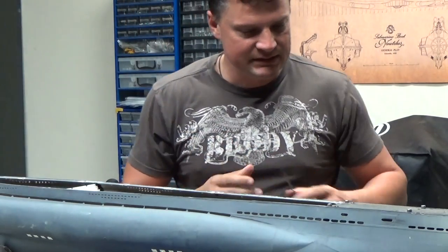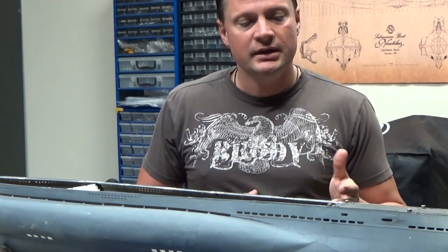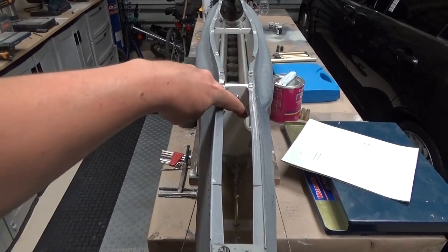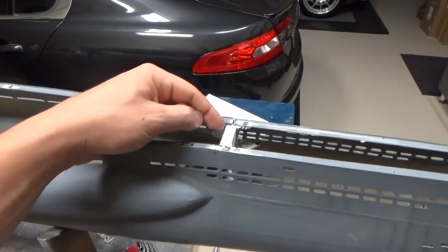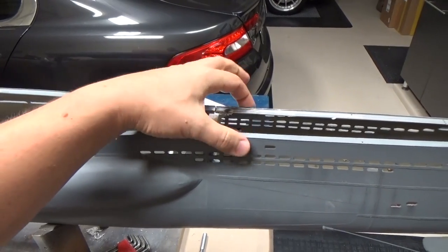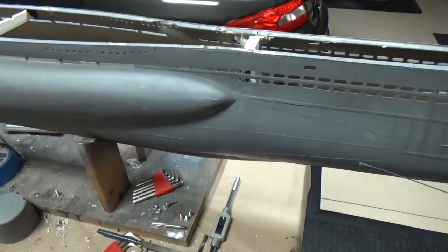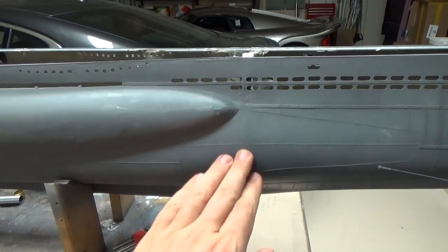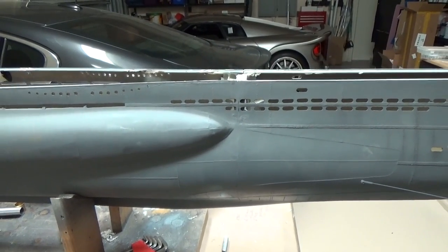The removal is actually really easy, but the little button magnets are quite powerful and I'm not worried at all about them coming loose during operation. Taking a look at the inside of the boat — this is the bow. You can see the forward bulkhead with an opening for the forward linkage for the forward torpedo tubes. There are two bulkheads — the forward one attached to the bow, the rear one attached to the centerpiece. The seam has been sanded flush and primed over, so once separated it should just be a hairline seam.